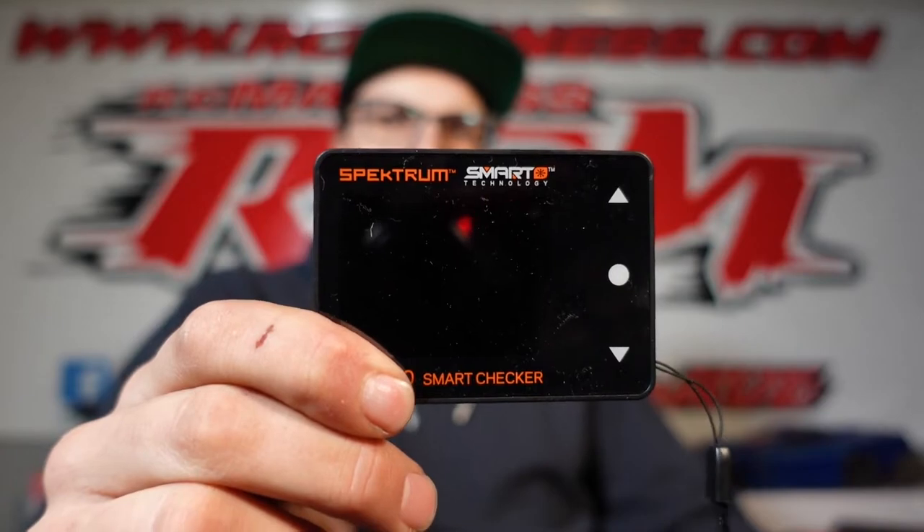I know it's nothing crazy, but sometimes it's the little things in the RC game that make me happy. The Spektrum Smart Cell Checker has been pretty sweet — I've actually been carrying it in my pocket because I'm constantly checking batteries. I also use it in conjunction with my charger, hooking the battery balance port in here to watch cells come up evenly so I don't damage any batteries when jump-starting dead ones. Shout out to Spektrum — not paid by them, but I do like this product. Consider picking one up. Thanks for watching, make sure to like and subscribe!